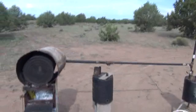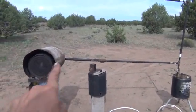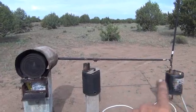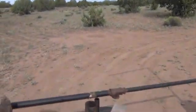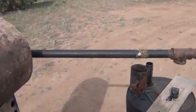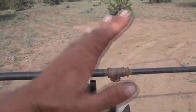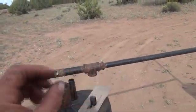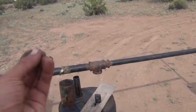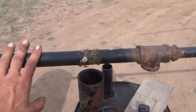Let me back up and show you why it's working this way. If you notice here, there's a downward slope to that pipe going through there. It's working opposite of thermodynamic pressures. What that's going to do is actually force the smoke to release as much of this crude as it possibly can, because the smoke is actually wanting to go uphill, which would be easy. By forcing it slightly downhill, we're forcing a lot of that heat energy out, making sure it's releasing a lot of that — let's call it creosote or bio crude.